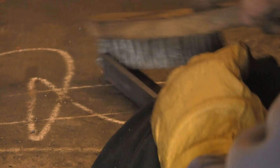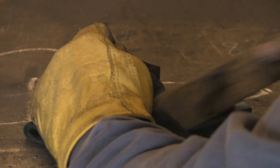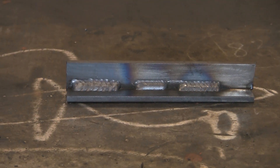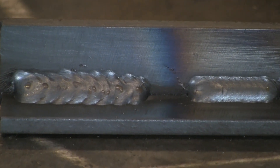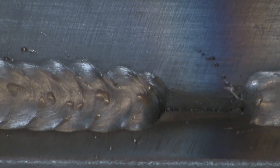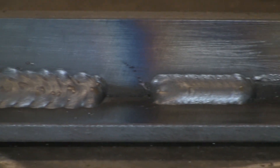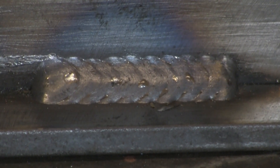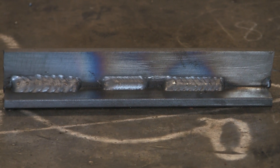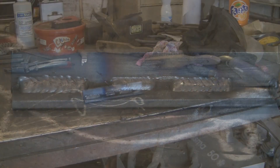It's getting really hot now. Get a quick brush up so you can compare. You can see it's messier, it's slightly wider. Still not undercut — those bright bits at the top are just reflection, not undercut. But that's the messiest of the three. If I was doing a normal everyday job I wouldn't worry about it, but that middle one — if I'm doing something really neat — I'll try to get it to look like that. My everyday average weld is the one on the right.